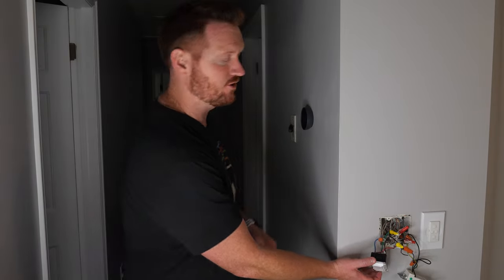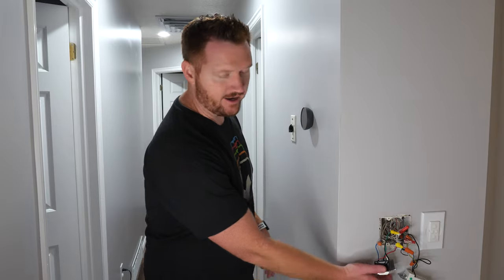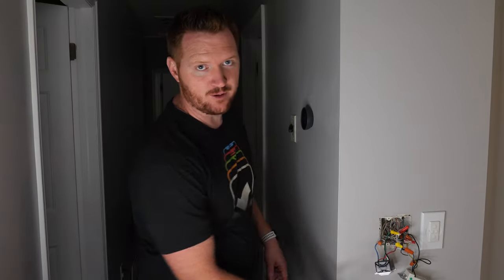After hours of troubleshooting I could not figure out the problem. I tried all kinds of different combinations, even called Lutron, and we couldn't get it to work. I believe there is a problem with my wiring on the neutral wire — I do have two circuits coming into this box that are combined, and something seems wrong there. So I ended up taking off the Claro switch, moving it to the second location, and putting the jumper wire with the mechanical switch at location one. And now we successfully have the three-way switch working with both of those.